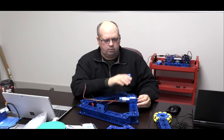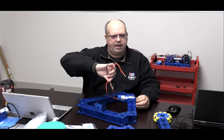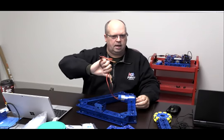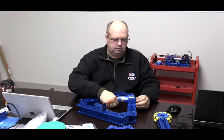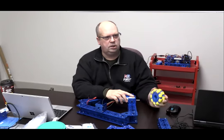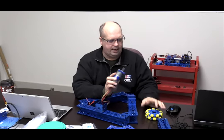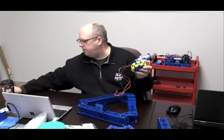All right. So you want to put all of that together. Make sure you still have access to your wiring, because we haven't done anything with either the power cables or the encoder cables yet on these motors. And you're good to go. So you can get your frame together. And then once you get your frame together, you're going to mount your Omni wheels onto that. And I'll get James to go back onto the small screen and just cover the Omni wheel mounting.